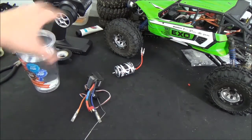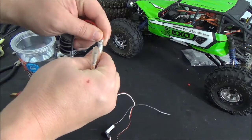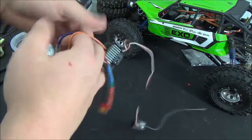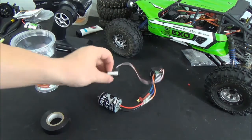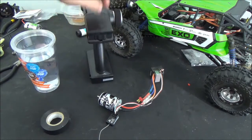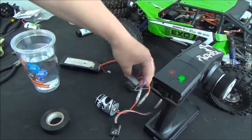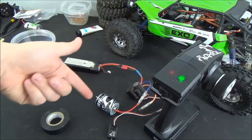We've got everything set up. We've got our new motor set aside. What we're going to do is go ahead and connect it to the speed controller. Use your motor cables here. Mine are pretty well insulated and they're also pretty tight, so I'm not going to have to worry about them coming apart. But if they're not very tight, you want to use some electrical tape to wrap around these and hold them together, because you're going to be hanging the motor off into the water from the wires. So you definitely don't want that slipping off or coming disconnected in the water. We're going to go ahead and hook the ESC to the throttle channel of your receiver, connect the battery to it, and turn the speed controller on. It should go through a little initial startup.